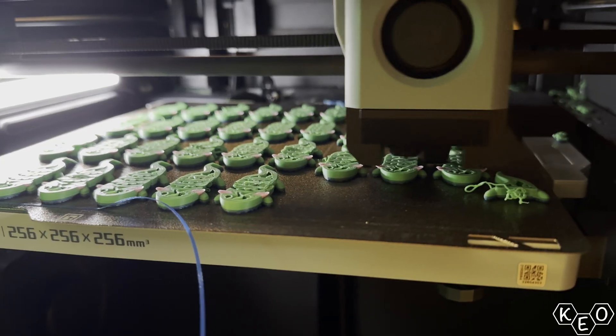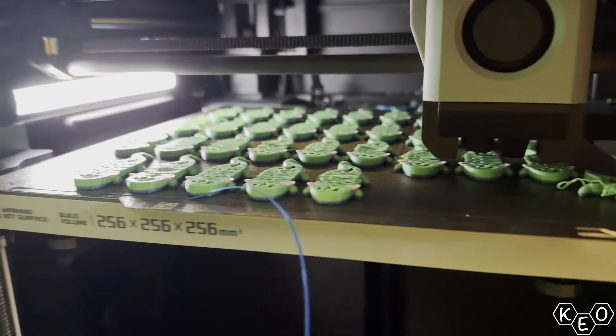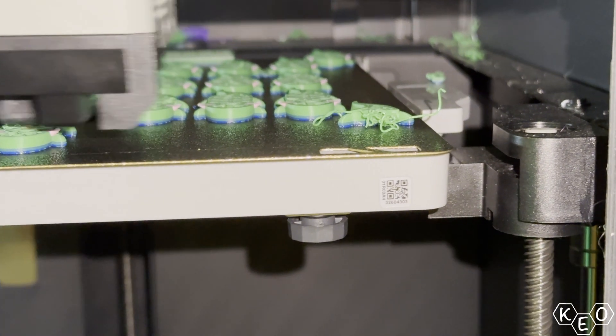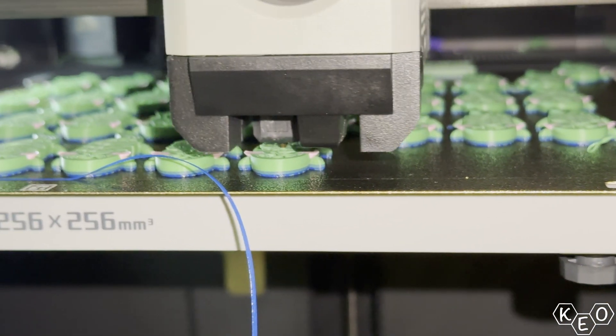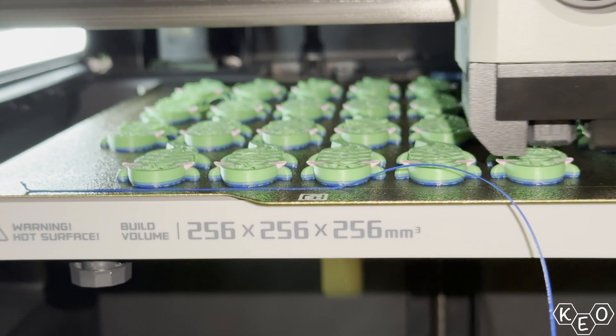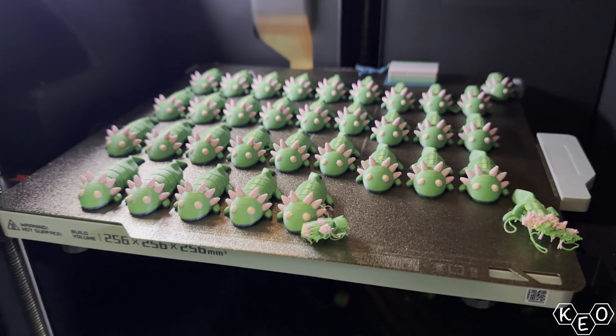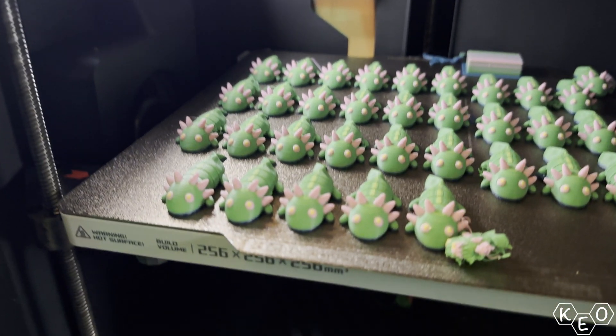If you're doing a huge batch and filament collects on the nozzle while it's jumping from model to model, this could end super poorly. It's only a matter of time until that excess filament gets deposited on a part. Best case, it gets embedded in the surface and you lose that part. Worst case, it knocks a model free — and now the printhead resumes printing on all models as if they're all there. When it gets back to the knocked-free model, there's nothing to catch the filament, so you get spaghetti, which balls up and hits adjacent models, causing a cascading failure. More spaghetti, more failures, wasted filament, no models.